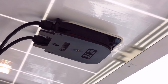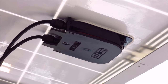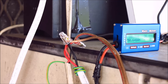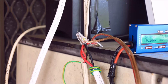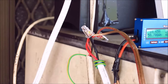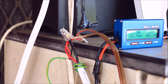I'm only getting a maximum of 37 volts, which is really close to 30 once you put a bit of a load on them. Then I'm running that back down through the controller to 24 volts. The two panels are positive to positive and negative to negative — that means they're parallel, so you get the same volts at twice the amperage. Amperage is like the strength of the volts; the more amps you have, the more load you can drive at that voltage.